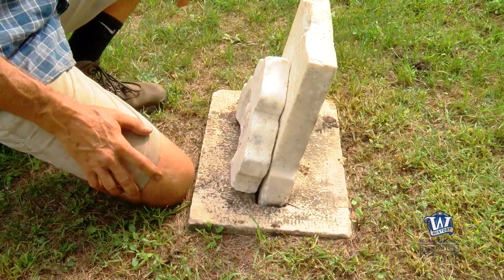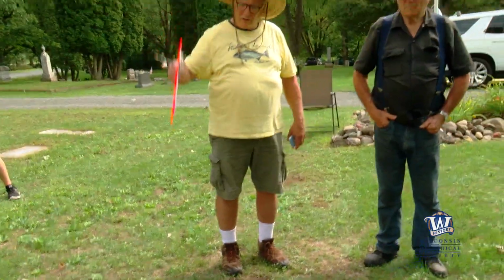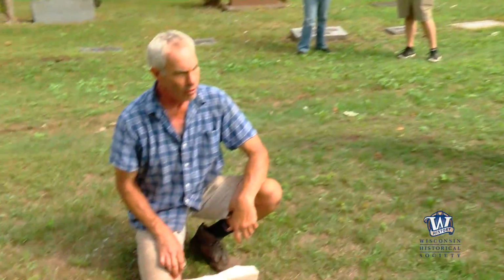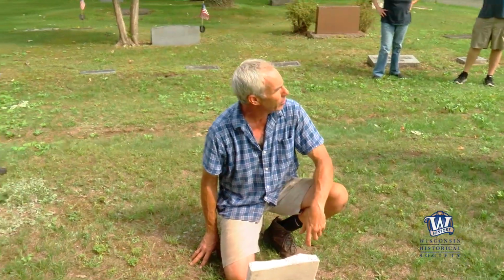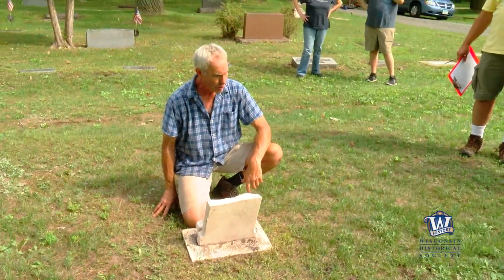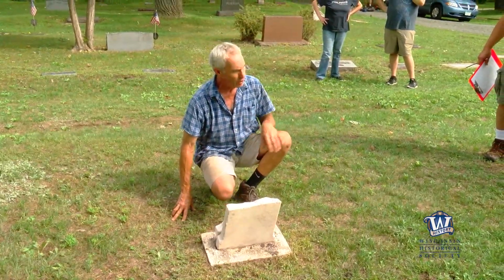The pointing mortar, is that the gray stuff you're using on tucking in around on that? No, we didn't get that out yet. That's more like a mortar you add water to, but there's no Portland cement in it, and it's going to be an off-white color. It's going to be softer than a conventional modern mortar, because modern mortar is super strong and hard and tenacious and impossible to ever get off later. So it's more friendly to the stone.